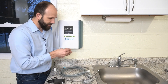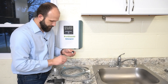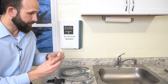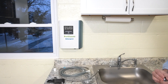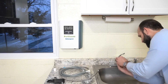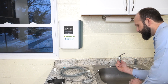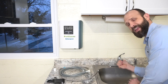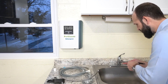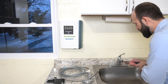For our sink, we're going to need to put three rubber washers inside this little thread here so that it won't leak. I'll go ahead and attach that — it'll depend on what type of sink you have. It just screws on. I might be able to get away with hand tightening it, but I'm going to take channel locks and give it a few more turns to make sure I don't get any leaking once the water starts running.